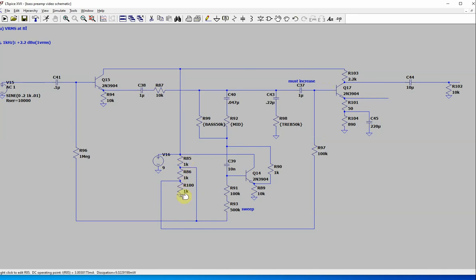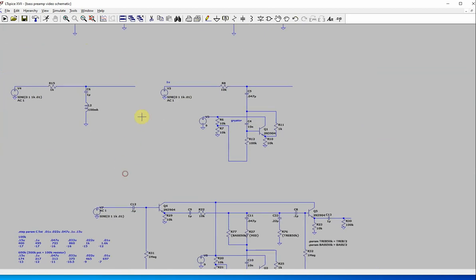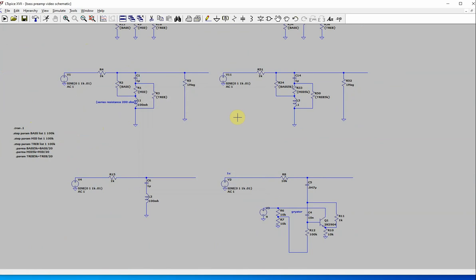I put three resistors here, and this one here is going to be about 2/3 of 9 volts. This is going to be around 1/3 of 9 volts. And then you see this subtracts off 0.7, and so you're down at around 2. And then this is a gain of 2.2. I'm not going to get super into this. You've got a gain of 2.2 in 1. Let's just see where the biases are there. I didn't really even calculate it because I thought this would work well enough, and I think it does. It certainly did when I tested it, but let's put this here. Okay.